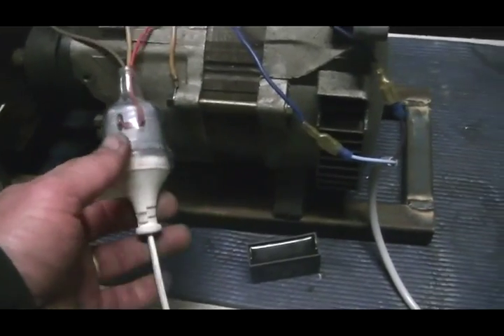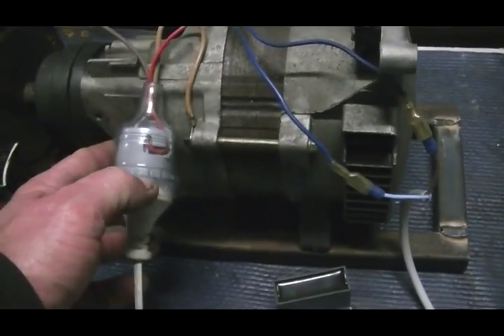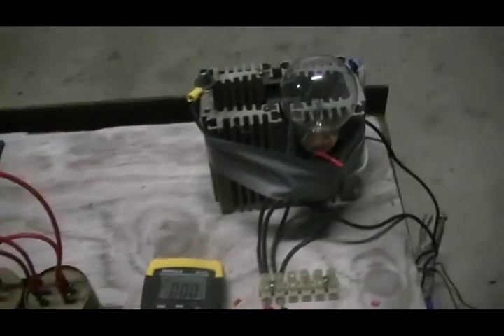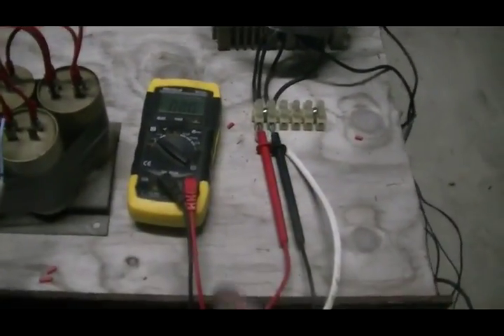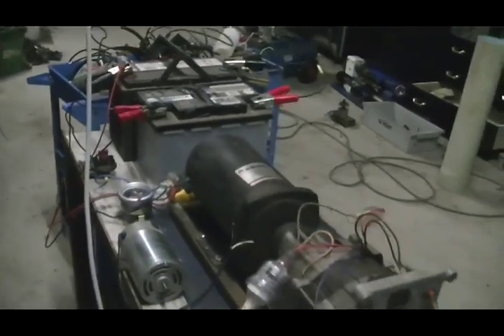This is its own little winding, so I'm guessing it's just to build up the magnetic field in the generator and shift the phase slightly, so we get our 50 Hz — or 60 Hz over in the USA. Anyway, we've got a 60-watt bulb here and our meter to show the voltage. I've disconnected it from running through the run batteries as it didn't really seem to make that much difference.